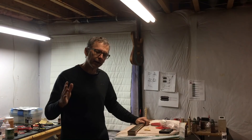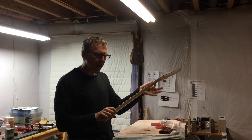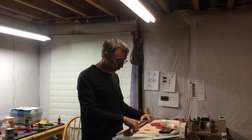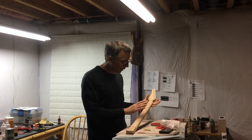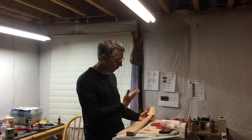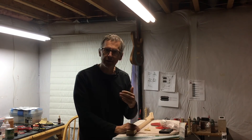The cool thing about CNC is the technology I use for rough carves. If a customer says the neck feels a little too fat and they'd like a thinner profile, I can go back into the CNC file and adjust it so the next neck I carve will be thinner. I can set the original neck aside, pull out a fresh blank, and make a new one. Or if possible, make the changes right to that blank without starting over. Just knowing I have that ability makes it easier to build a guitar that's exactly what the customer wants.